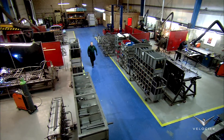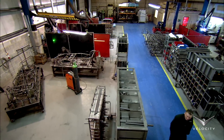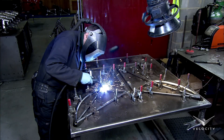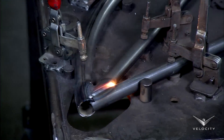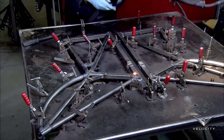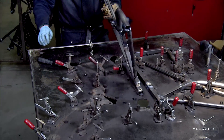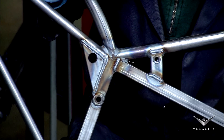At the Westbury Welding Shop, workers assemble pre-cut high-grade steel tubing to form the chassis space frame parts. A welder assembles a chassis part called the bow on a jig and welds the tubes together at very precise angles using an electric TIG welder. He performs a visual inspection to make sure that all welding seams are solid and strong.